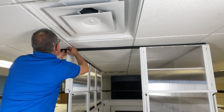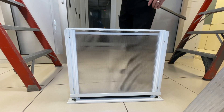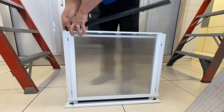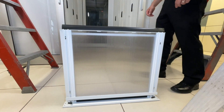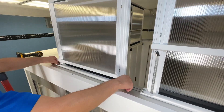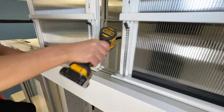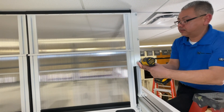Now we're going to take a quick measurement with the other panel's gasket. We want to touch the two gaskets in the middle and then cut it at the left. We're going to align this new piece with the curve going inward and align it to the opposite side — in this case, the left-hand side. Now we can raise the panel into position. Repeat the process on the left-hand side, tighten it down, and torque it with the drill driver. Lift it up and make sure your gaskets come together at the midpoint. Then screw in the opposite corner piece utilizing the four remaining bolts.